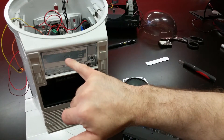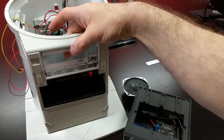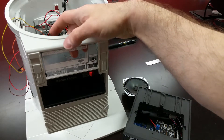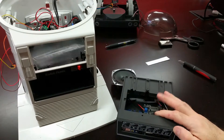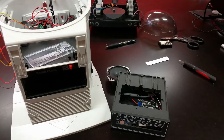There needs to be a forward distance sensor up here. In the base, we had the right and left sensors down by the floor, but we want the forward sensor up here higher so that Roby knows he can't do things like climb under chairs and tables. I'd like to put one in the head, but the sonic sensor is just a little bit too big to fit anywhere on the head that I would approve of aesthetically. What I need to do next is start wiring the Arduino directly to the base using connection wires, hard-solder the sensors in — that will make it a lot easier to organize — and then start uploading the autonomy software.